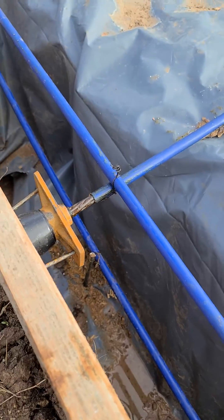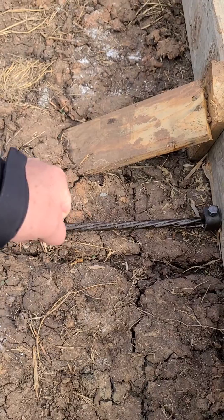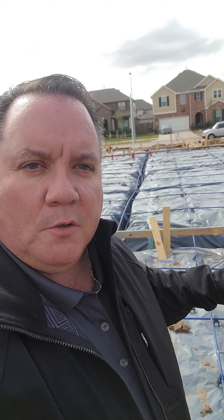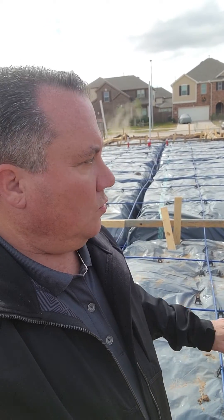They can go to the other end of the cable, grab ahold of it with their machine, and then pull on it to put tension on that cable. Part of the process is getting a certain amount of stretch on those cables. When they do that, they know they have a good bit of compression on that concrete, which keeps concrete strong. Concrete in compression stays strong; put concrete in tension and it tends to get weak and crumble.